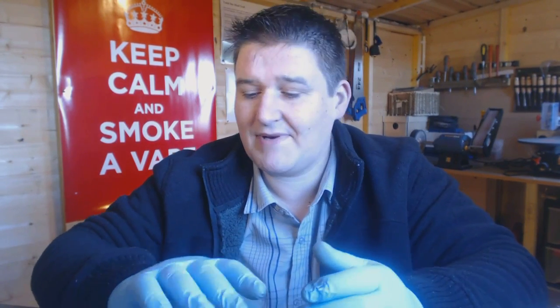The key things to remember here are, never go in too hard straight away. So never use grade 50 wet and dry sandpaper straight away. Always use the least abrasive method to start off with. So for polishing, just use Autosol or Brasso or whatever metal polish you can come across. You get things like the Cape Cod cloths, which are basically just cloths soaked with a bit of Brasso. And you just wipe the surface and it brings them up lovely.